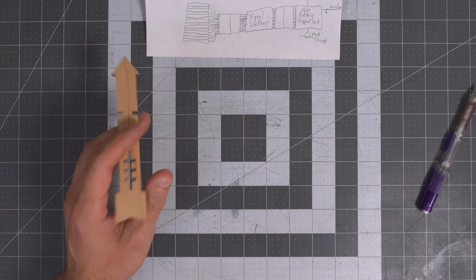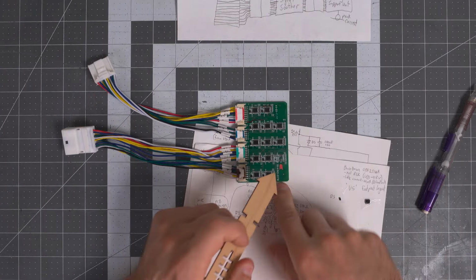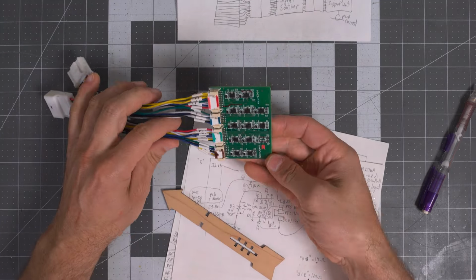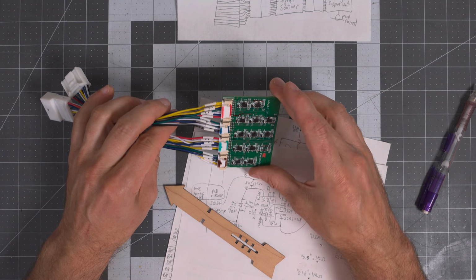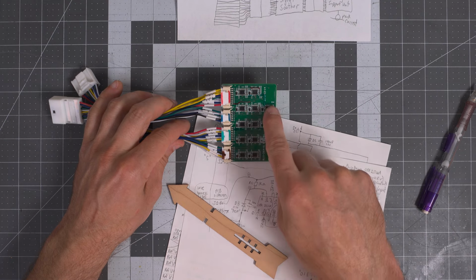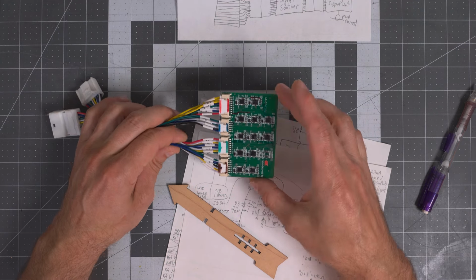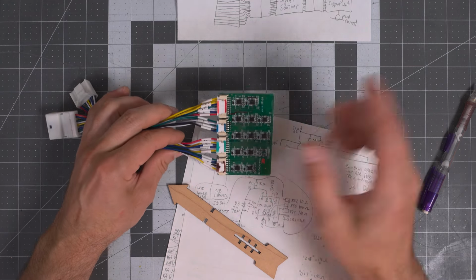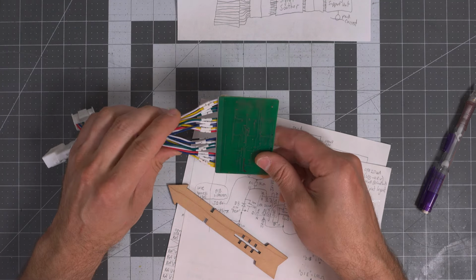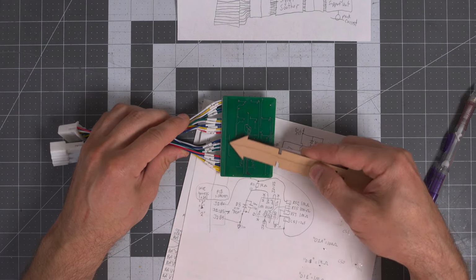So I went and took one on our signal soother here, I just picked V5, and just some commentary on this circuit board. This circuit board is not laid out well. There are traces on this board that go somewhere and then just stop. There's no via, they don't go anywhere. There are also some high voltage violations. The most egregious theoretical one would have been a V14 to B0 or V0. But actually we avoided that because this trace, I think probably just by the luck of the draw, ended up being on itself.